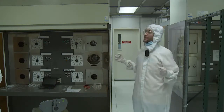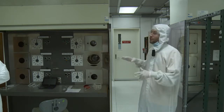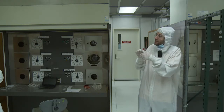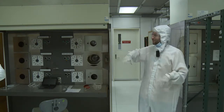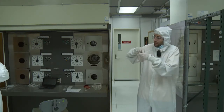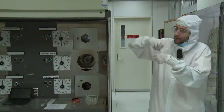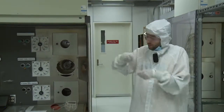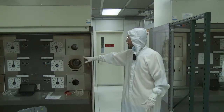It's like blowing glass. Probably you've seen the traditional way of making glass, where you blow the glass and make bottles. They use exactly the same technique but for microfabrication. They make very, very tiny holes in silicon, and they bond it to a glass wafer, and then they heat the glass to super high temperatures. Then instead of blowing, they put it in vacuum, and there's some air trapped underneath the glass wafer, so that presses the air to make very cool bubbles. You can see them in our department, in one of the corridors, and they call them glass wines and fancy names. But so that's cool. So that's what that is for.